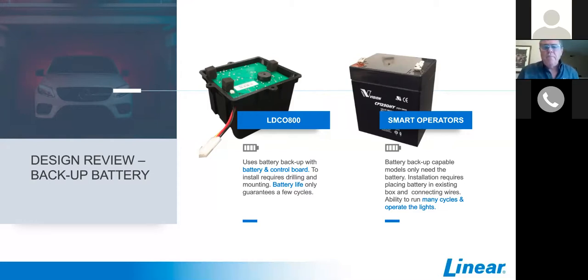On the 800 battery? Mm-hmm. Okay, so the 800 battery, the BBU, is an option for the rest of the country. It does not ship in the box, nor does it ship in the box for California installation, but it does need to be installed. So you would order a BBU with your 800. This is what the logic board inside the operator looks like. And this is the connector. You disconnect from here and plug it in to the battery housing plug. And now your operator is battery backup.